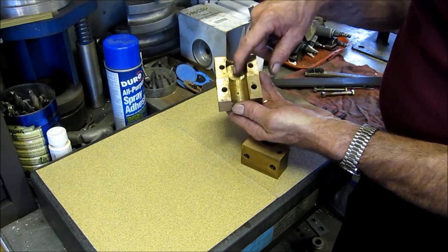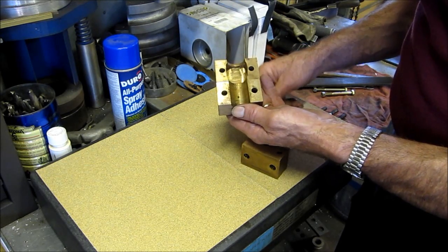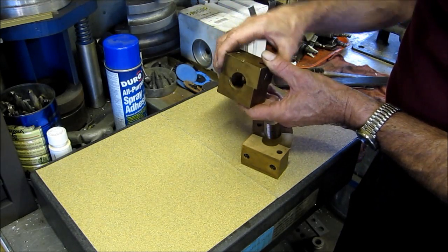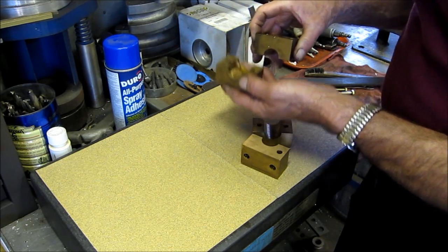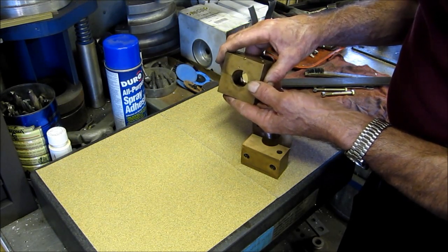This is the pressure side. This is the oil bath side. We'll make a piece of felt in here afterwards. When the oil is squirted into the little orifice there, it goes in around the shaft. This cavity here you preload before you put it up there, so you don't have to squirt a lot in at the initial start.